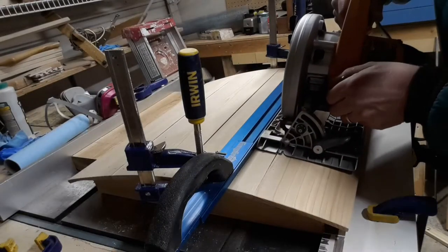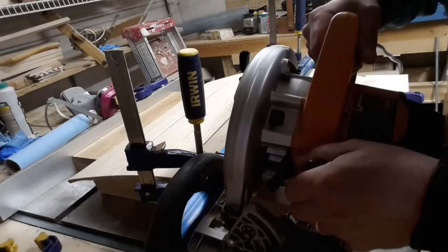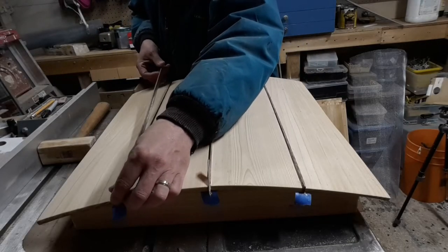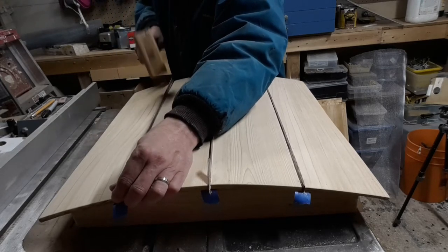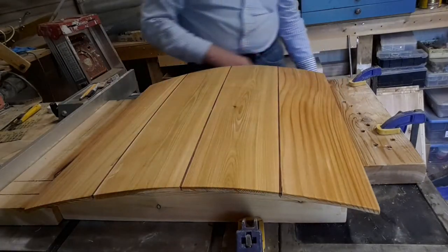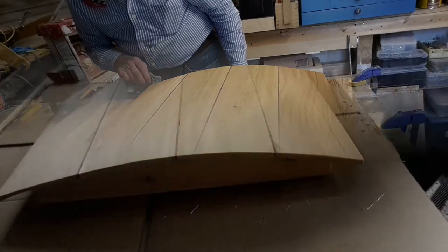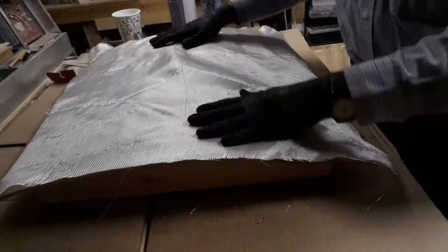Some of this stuff I make up as I go along. I decided I wanted to widen out the cracks in the boards and put in strips of contrasting black walnut — it dresses it up a little bit and was made from a few scraps I had around the shop. After planing down the strips and wetting out the top to better see the scratches and imperfections, I do a quick finishing sanding one more time, and then it's time to lay some fiberglass on top.